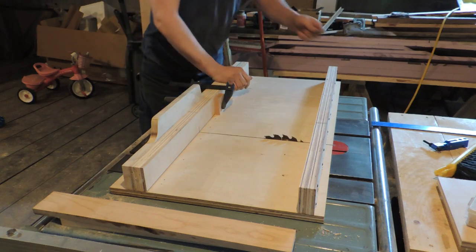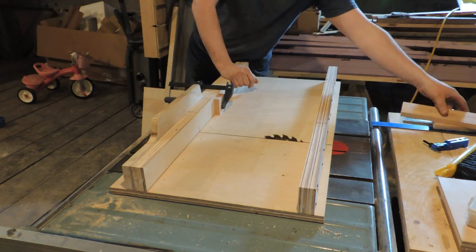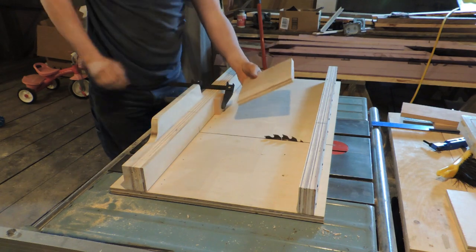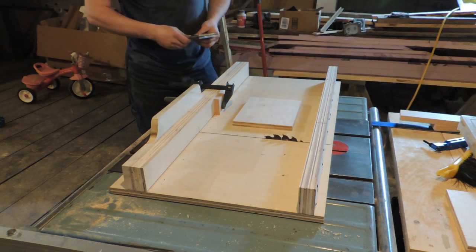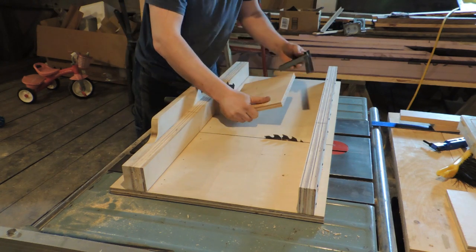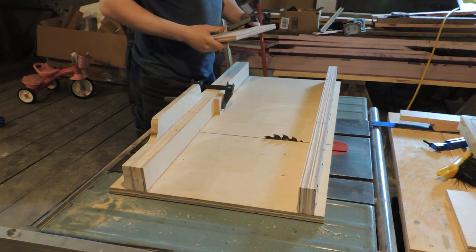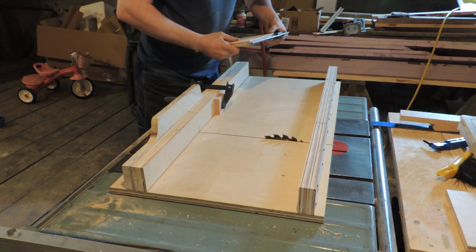No way we got it that good the first time. No way in hell. So let's discuss this crosscut sled and its design and what we are doing here. This is a very, very simple crosscut sled — very easy to build. You saw me check and recheck that test board because I just couldn't believe that on the first shot it came out that square. I've never had one come out exactly where I wanted the first time. It's usually one of those things where you sit there and fiddle with it until you get it exactly where you want it. The big thing is you just go around and look for daylight — if you don't have any daylight, you're doing really well. Little bits can really throw you off.